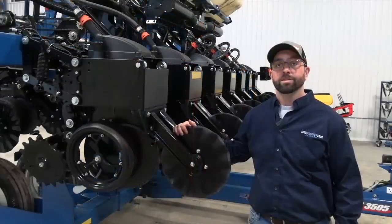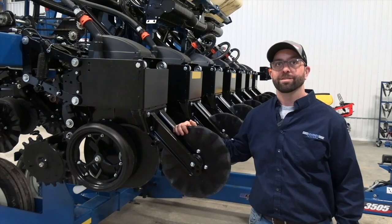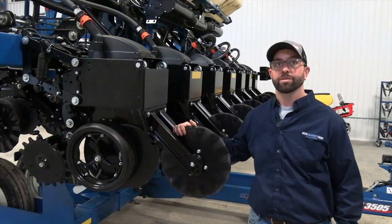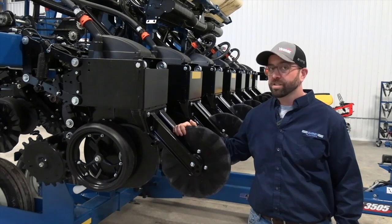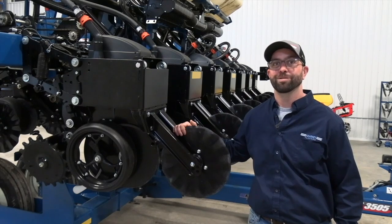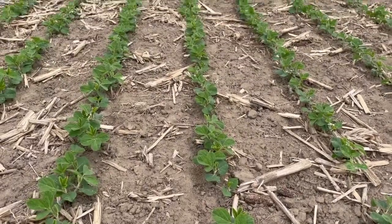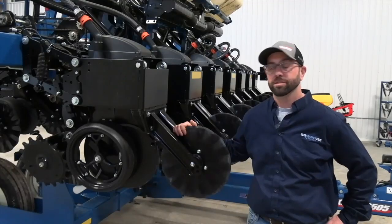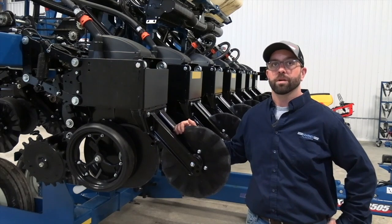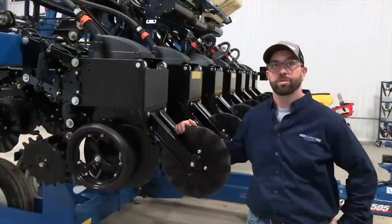Up first is a common question we get quite often — no-till coulters versus trash wheels and how that's going to work. There are lots of options, lots of different configurations. If you're planting soybeans on 30-inch rows, none of this really applies to you. But the narrower the row, the more trouble we seem to have with trash and trash wheels. There are single-arm versions, narrow versions, and short-arm versions. At fifteen inches and under, we run into a problem with these due to trash flow. We can put narrow gauge wheels on, but eventually what it comes down to is we're pushing trash from one row into the other.